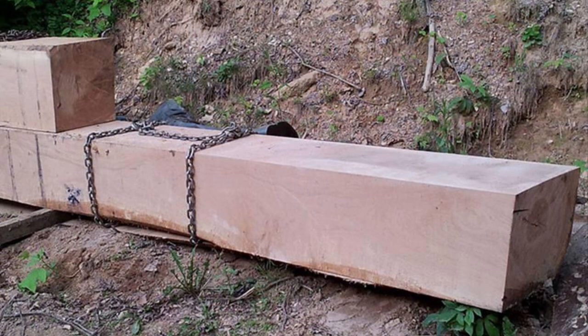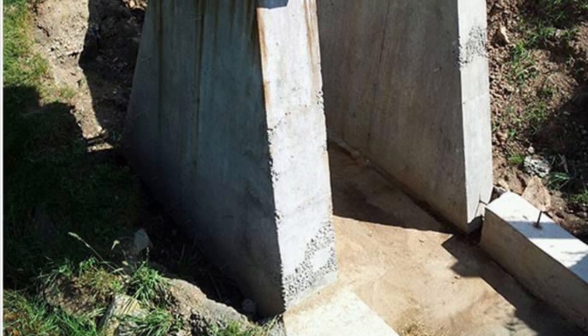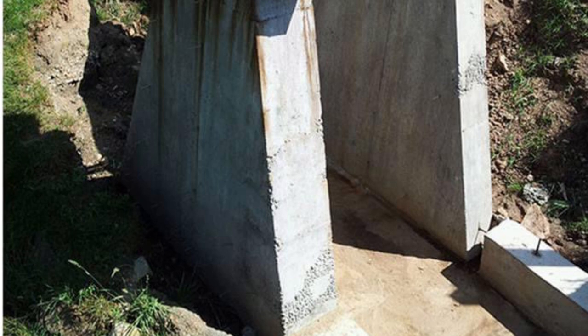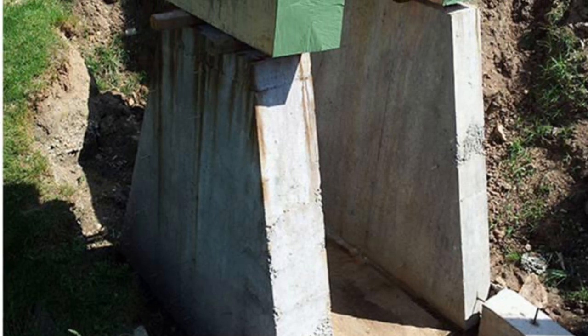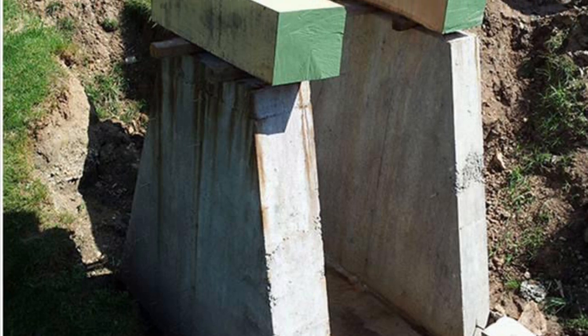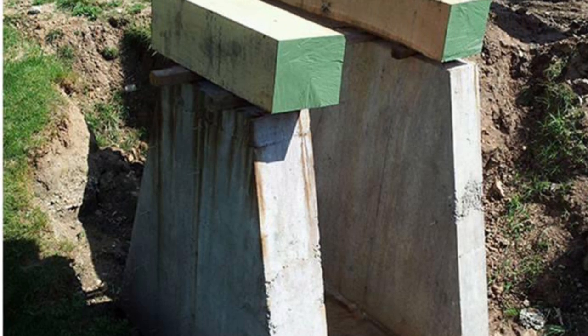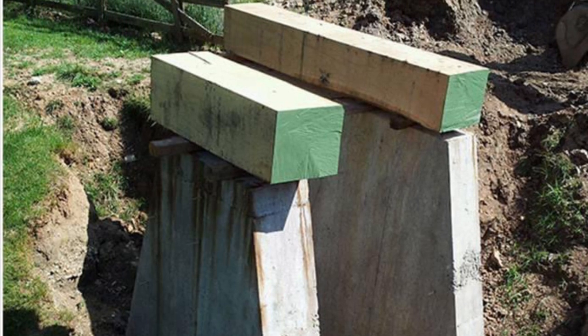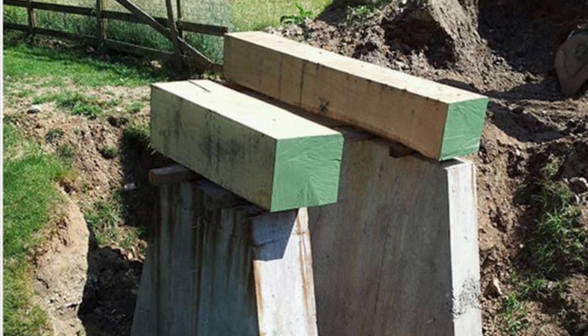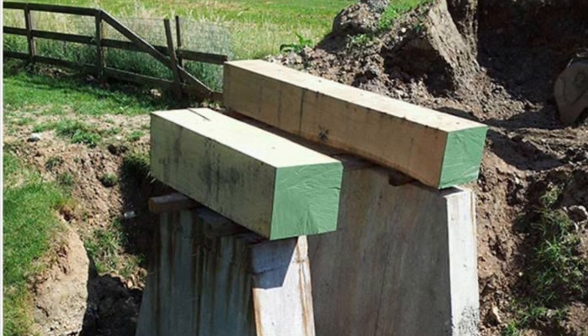The main carrier beams for the water wheel I milled on my sawmill, and they were 18 by 18 inch square chestnut oak. The foundation, pit, and wheelhouse were poured in two different steps, then the carrier beams were mounted on top of the piers. One reason for doing this is the wood acts as a cushion between the bearings and the concrete for smoother operation.